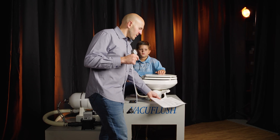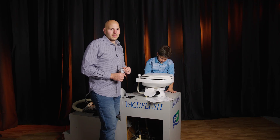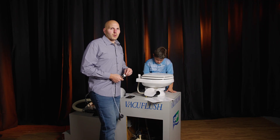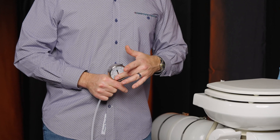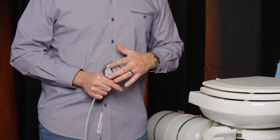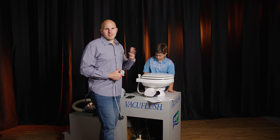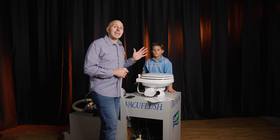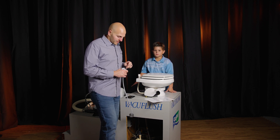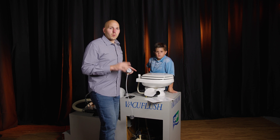So how do you use this gauge? The first thing you want to do is make sure it's at zero. If it's not at zero, you may have to gently pry the little rubber cap and tap on the gauge to get it to go to zero. Just because of shipping — it's up in an airplane, on a rail car going through mountains — atmospheric pressure, like any analog fluid-filled gauge, can kind of get out of calibration.